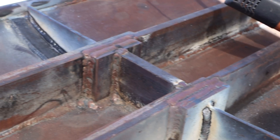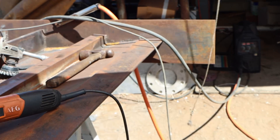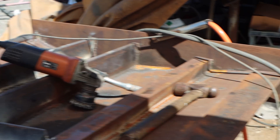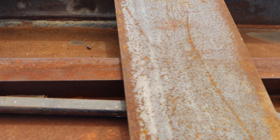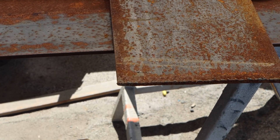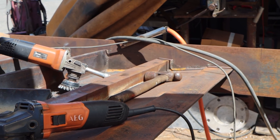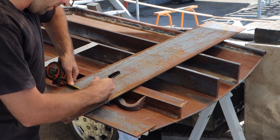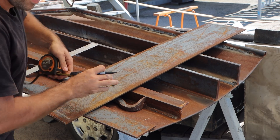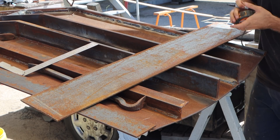Now that we've got these guys welded in on wing number two, I need to trim this back — just take that top edge off, I'll do that when I've got the grinder handy. I'm going to weld the same end piece on this wing here — it's just a piece of 200mm by 16mm flat bar. We're going to find our centre line and weld it smack on, centering it up and then continuous welding it right along the end. This one doesn't have to be super precise because we're going to trim quite a bit off, but we need it sticking out either side so that we've got some to trim.